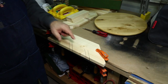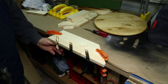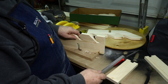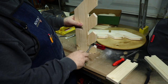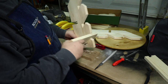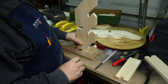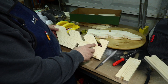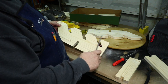These slots pop right out pretty easily — just hit it with the claw of my hammer and they just pop right out. Then I'll clean these up with the chisel to get them good and square. What I'm doing here is cleaning these up with the file to get them good and smooth and to get the opening tweaked so that these boards will fit in snugly — kind of a friction fit. Doesn't want to be real tight, but don't want to be too loose either. I'd rather these be too tight than too loose because I can make them larger with the filing.